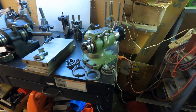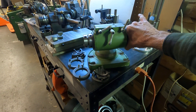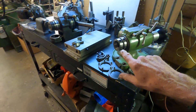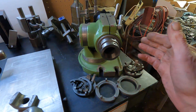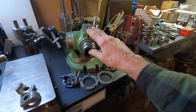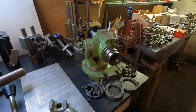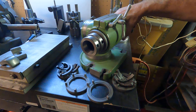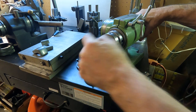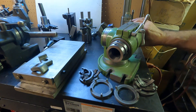We're going to start over here on the table with the accessories. This is a tap grinder, and it's a copy of the K.O. Lee — nicely made, heavy iron. Here's all the cams for it, and it's 5C with a 5C adapter. He's thinking $275. As you turn it, you can see the spindle go forward and then jump back. You put on the cams for the number of flutes, and there's right-hand and left-hand cams. That's complete, with the drawbar.